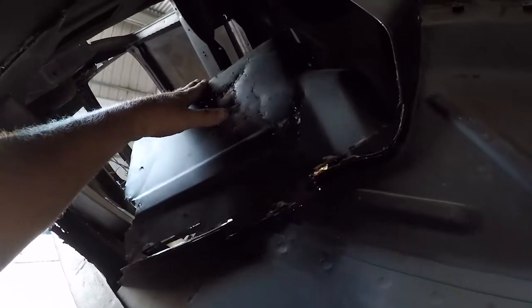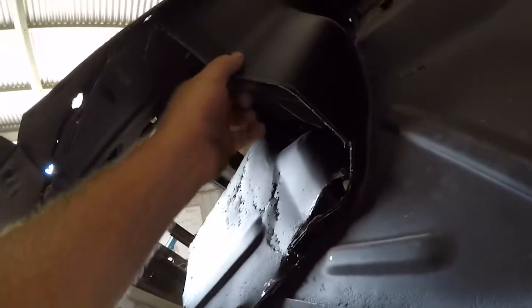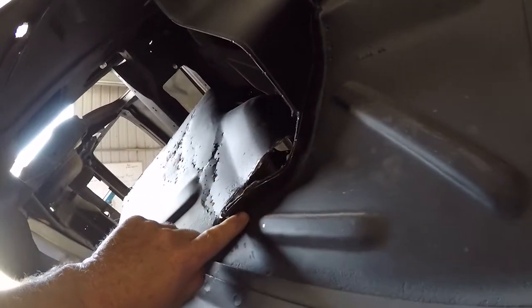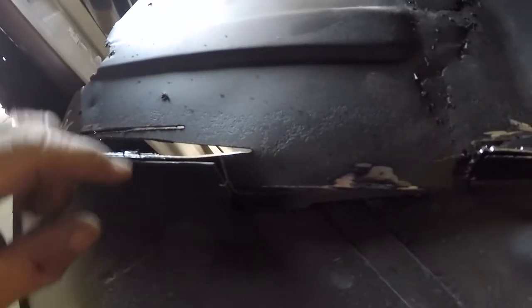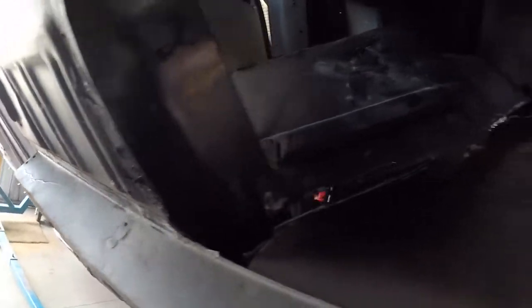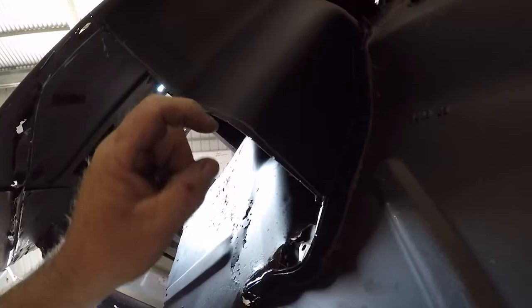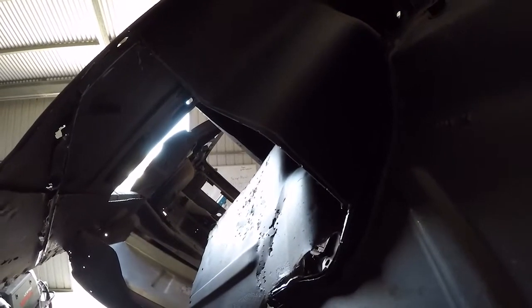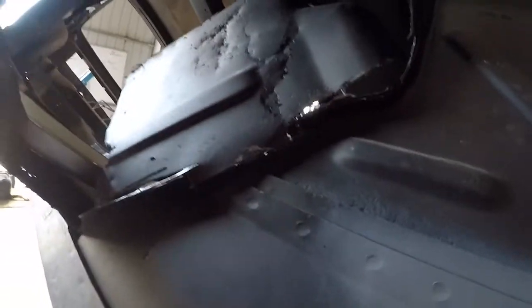Just showing you where I've done a bit of a cutout of the panel — let's do a little bit more cut through here. I thought I'd get some footage while it's still holding in place. Good strong steel. This is part of a folded joint here which is what we'll use. What we'll do is on this side of the chassis there's a split seam there — we actually drill those spots out. Then we'll attach that floor pan to that, so this internal floor pan sits flush against that. You can see the guide holes I've used along here. It's always better to cut a little bit shorter — measure three times and cut once. Once we get the floor pan sitting in there to have a look at it, it'll be alright.